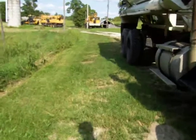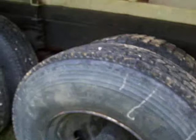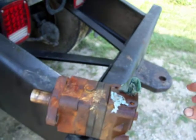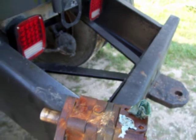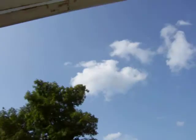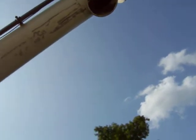Yeah, we've got a few little maintenance issues. That auger has been giving him trouble for a while now, and this was the motor it had on it. They've had it to a few hydraulic shops, and I think it's got a new pump on the PTO. This motor ran fine, but at idle, when you kicked it on, that auger was singing. I swear it was running 2,500 RPM, and that is no good.